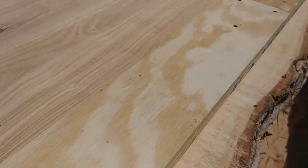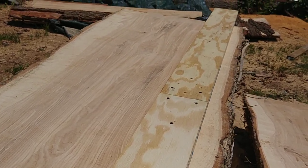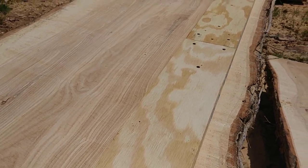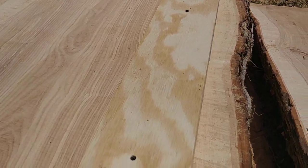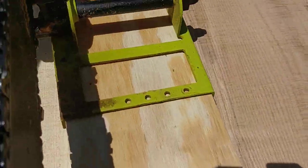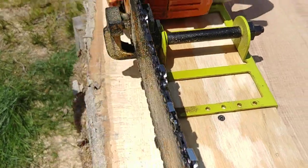And I made some plywood up, some 8-footers, and then a couple of 4-footers so I could stagger the joints. Ripped them all to the same width, and they're all perfectly straight. So just screw two layers together at 5.5 inches. Timberjig just rides on it. There's almost no side-to-side play.